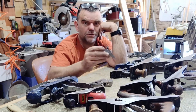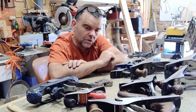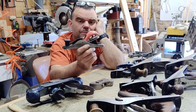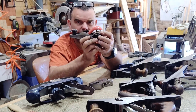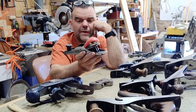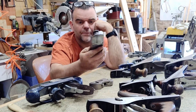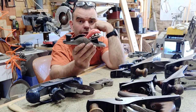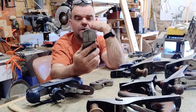The plane angle is very similar to the bench planes, but then we get into the realms of what we call a low angle block plane, such as this one here. This is one of the cheap Stanleys — it's not made like we're used to. It's got plastic knobs and a funny little straight wheel thing for locking the plane iron and the wedge. It's not the best thing to use, but it still works — it's just not as nice to use. It's relatively low angle, so that's good for doing short grain or end grain. You'd still require a stop block on your end grain so you don't split the end fibres.